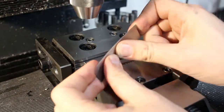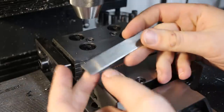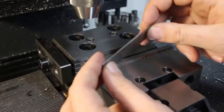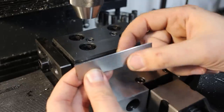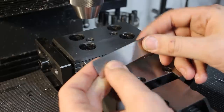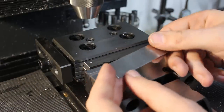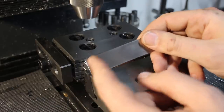We all know spring steel — this is commercial grade spring steel which comes already spring-hard. It's very useful material. It can be used to make springs, but it's also great for wear surfaces because it's seriously hard and relatively precise in thickness when rolled. You can make parallels out of it, thin parallels, and you can machine small precision parts directly out of it with no additional heat treat. But drilling can be a little challenging — it mills quite nicely with coated high speed steel or carbide tooling, but drilling can really be a bear.